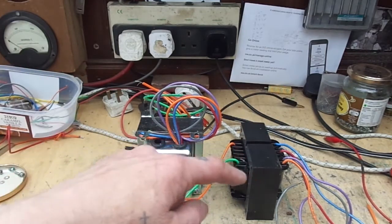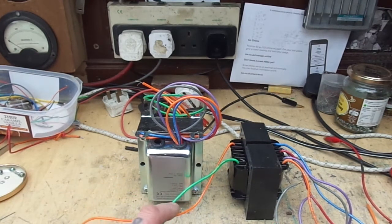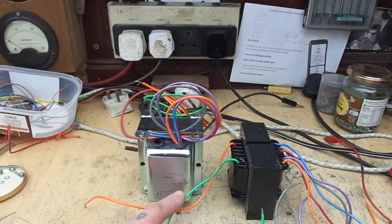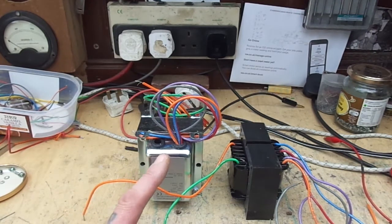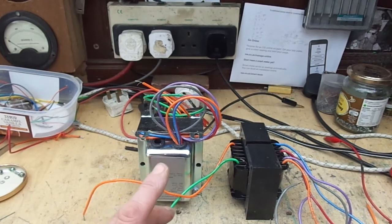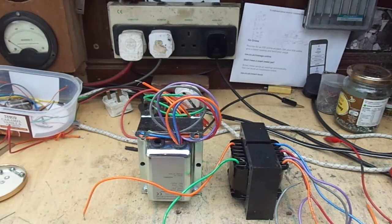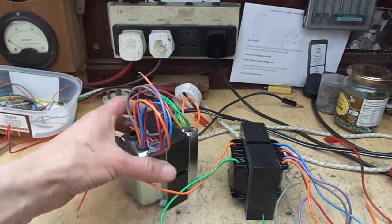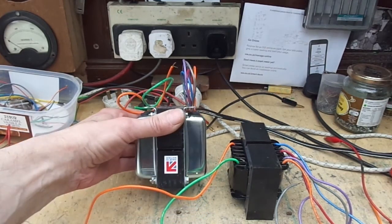There are a couple of output transformers, 8K primaries. They have got screen grid taps, but they won't be used. This is for another AB2 amplifier, but it'll be using a dual triode. So everything will pretty much be the same as the 6146 amplifier, more or less, but with these output transformers and different output valves. They're from a company in the UK called Primary Windings.